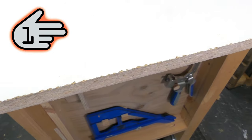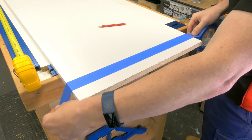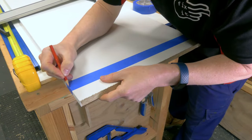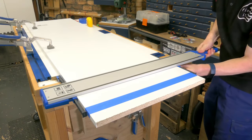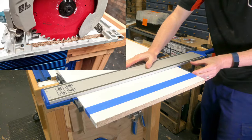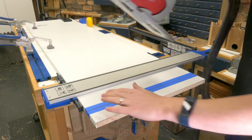Step one is cutting. We can't do much with this if we can't cut it, and there is a problem. Look at that edge — I cut that with a regular saw and that thin plastic on the outside has the nastiest habit of chipping out consistently. Best case scenario, you have a really sharp, really high tooth blade. But if you've just got a regular old circular saw with a fairly standard blade in it, there are a few things we can do to avoid the worst of the chip out. Blue tape is number one. The blade rotation is kicking upwards, which means the edge on the top side of your cut is the one that's gonna be pulled away from the substrate and therefore get the chip out. The bottom should be pretty good.